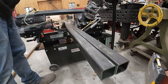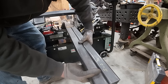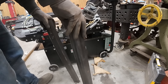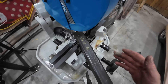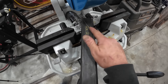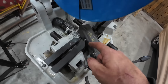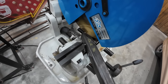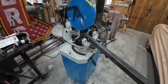Now I'm cutting the thick-walled 2-inch — the part I need is actually on the opposite side of the bandsaw blade; what I'm holding is the scrap. These are going to become the big arrow shape which points to the ball hitch on the actual Polaris. I need to cut this severe angle twice — this is going to be where the tongue is. This saw will not adjust to that angle, so I just welded on this piece of half-by-two to be able to get that cut. It's going to be a little jumpy because this isn't really supported out here, but I'll hold it while we cut.